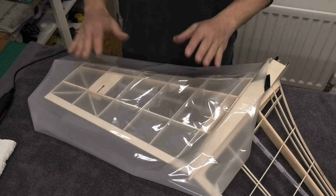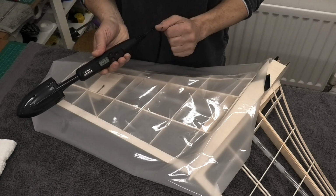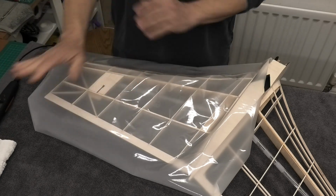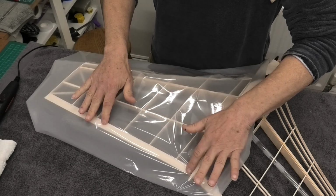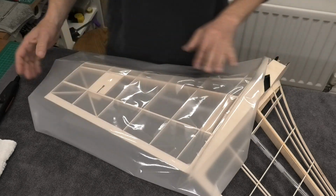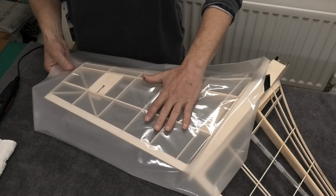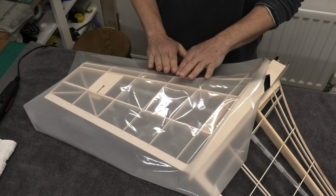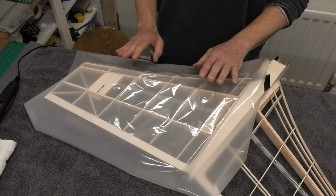Now when we start sticking this down, I'm putting my iron on. It's on 107 at the moment, but it's hopefully going to cool down to about 100 degrees C. And I'm going to start with quite a cool temperature, and I'm going to stick along this edge, and I'm going to pull along here and stick this end, pulling this nice and tight, and we'll do the back edge, and then we'll finish up doing this front edge. I think it may change as we go.